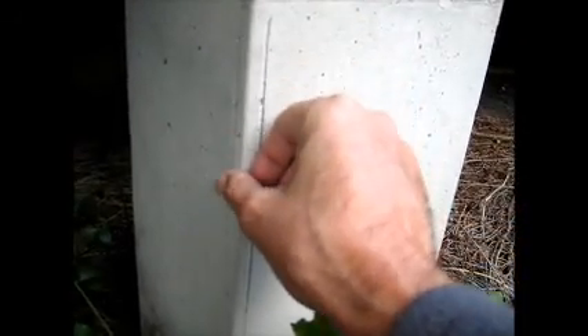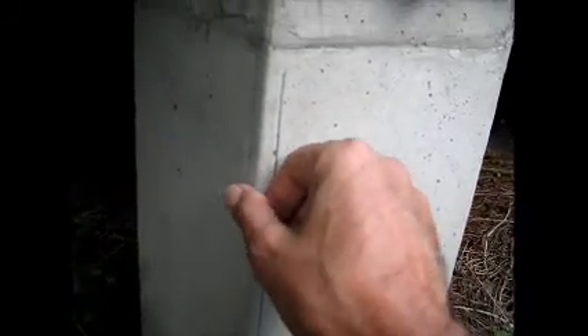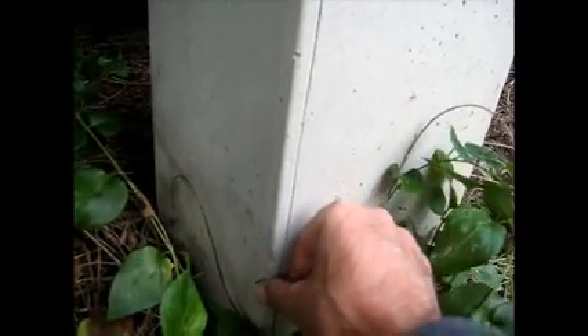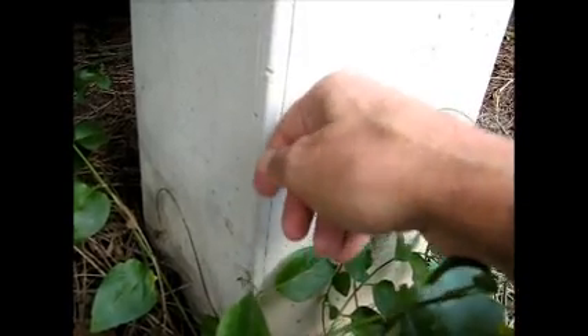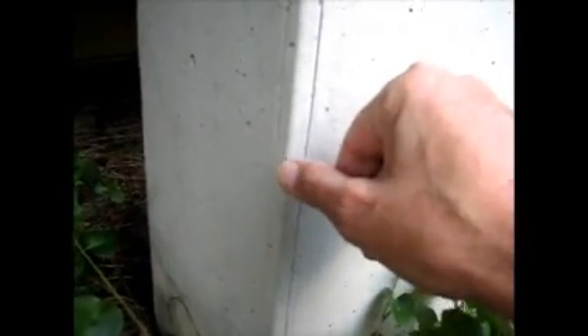A little tip: if you want a smooth corner, line the boxes for your piers. Put some silastic or putty in the corner of the boxes — inside the boxes — and smooth it with your finger so that you have a slightly curved surface. When your concrete is finished, you'll have a nice curved edge.